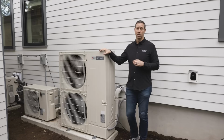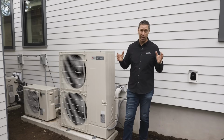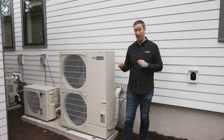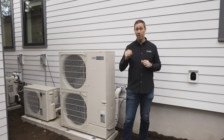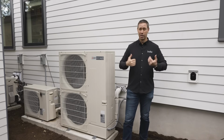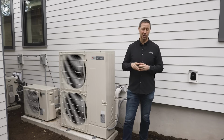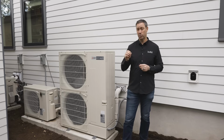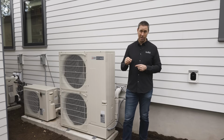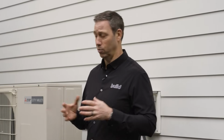When it was 105 out this summer, I did kick on that party unit to get some extra cooling capacity, because I found that if I left my thermostat at 75, let's say, when I left for work, if someone tried to kick that down, it probably would catch up eventually, but not by the time I went to bed at, let's say, 9:30, because it was 105 out that day. And in Texas, it's often in the 80s, even in the middle of the night. So we've got some really high temps. And in Austin in particular, our design temperature for our Manual J is 99 degrees. That's mandated by the city of Austin when you size your loads. So having that extra party capacity was really nice for me this summer.